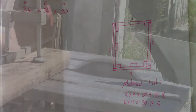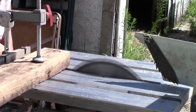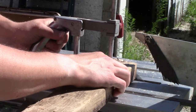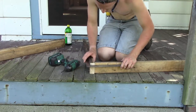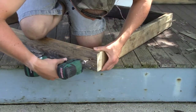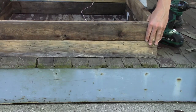Let's get to cutting all these pieces. I had to use my table saw here as I didn't have the chop saw yet, but whatever method you use is unimportant as long as you don't lose any fingers. I prepared all the boards for assembly by installing two construction screws at one end, then screwed the framework together using a framing square to try to get close to 90-degree corners. I was using rescued lumber I had torn out of my basement — far less than perfect, but still good enough for an outside deck box.